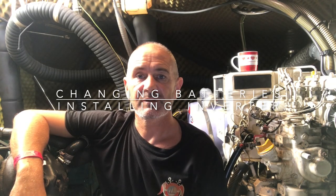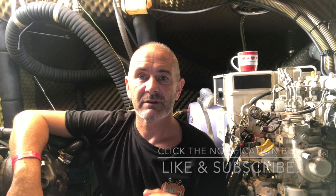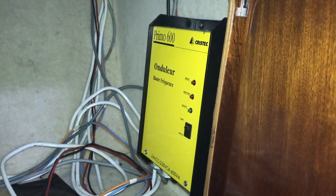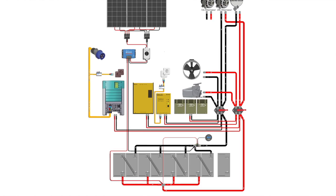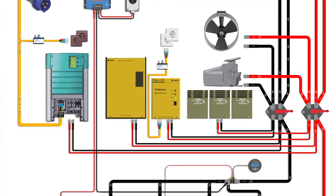We do have AC sockets on the boat but they only run on shore power or the generator, and what I really wanted to do was be more off grid — not use the generator as much and rely more on the solar. We do have an inverter on board, a 24 to 230 volt inverter, but it's only 600 watts and only has three outlets, none of which run to the galley or saloon area. At 600 watts it doesn't run toasters, kettles, microwaves, vacuum cleaners or anything like that, so it was definitely time for an upgrade.